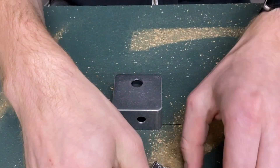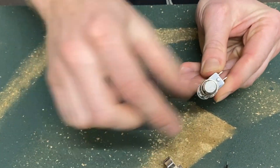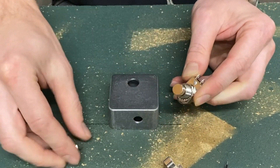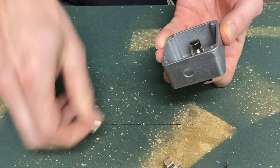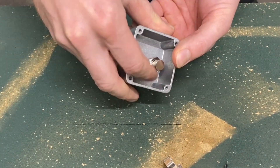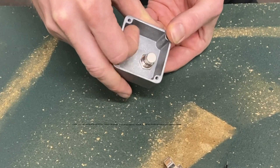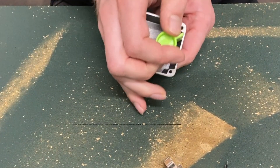Let's start building. We'll start with the footswitch — take your footswitch and remove the top nut, leaving the bottom nut and lock washer in place. I'll be soldering these wires outside the pedal for demonstration purposes, which is sometimes easier so you have more room to work, but feel free to solder the switch inside the enclosure. Insert the footswitch into the bigger hole and install the nut with a 14mm socket.